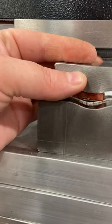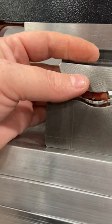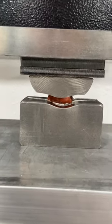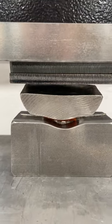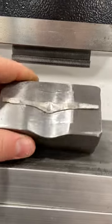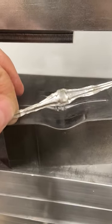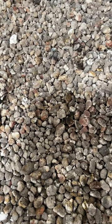It's important when using all of these tools that everything is centered within the press. You can see how I'm using the humpback ring former and a piece of urethane together. So you can see how I've gotten more down into the central portion of the ring. I've gotten a little bit deeper but I'm not picking up the detail of the die yet.